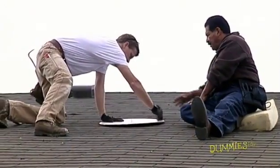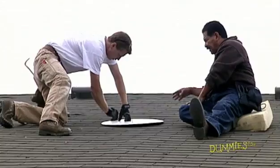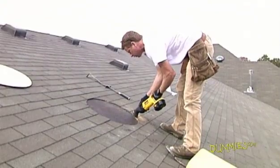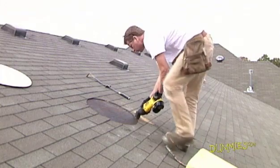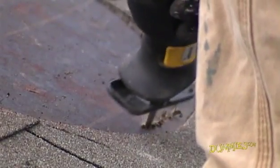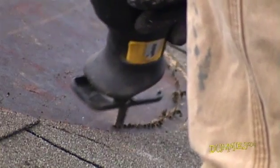Back up on the roof, find the nail and mark the top, bottom, and sides of the opening. Check the directions that came with your tubular skylight to make sure you're drilling the correct size hole. Cut the opening, being very careful not to damage any of the rafters.